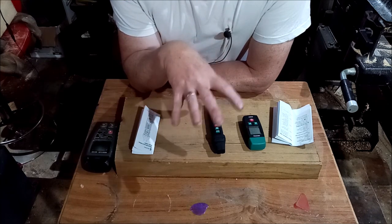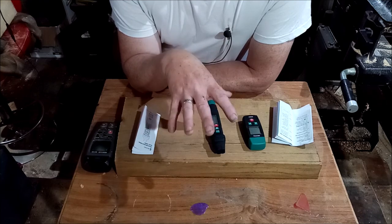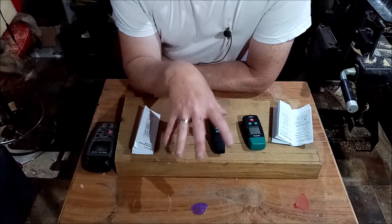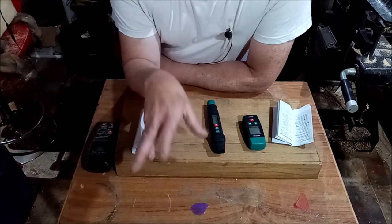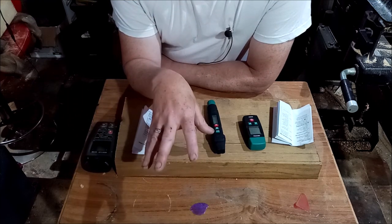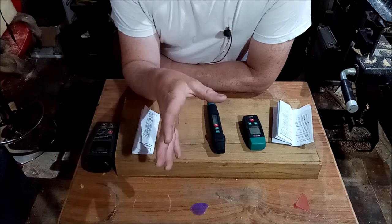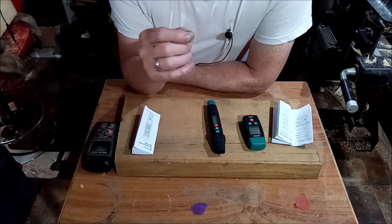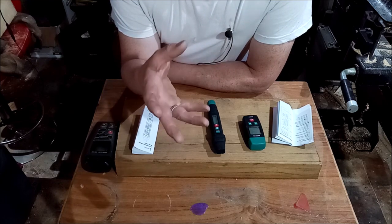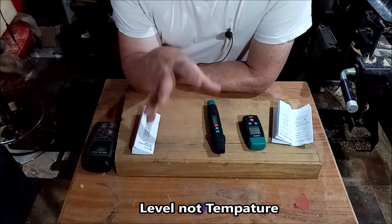And I know, depending on the weather, the ambient moisture level in this workshop is between 10 and 14. If it's lashing rain outside, and it has been for a week, the moisture level in this workshop is a 14. If it's been bone dry for a week, sun splitting the skies, it's 10. Right, how you know when wood is ready to turn is it is the ambient moisture level in your workshop.